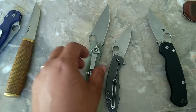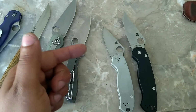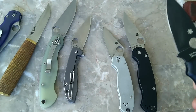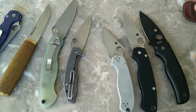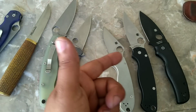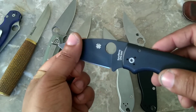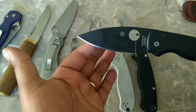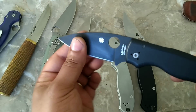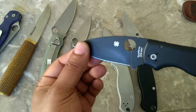Wear resistance compared to S30V. It gets bunched in. Some people look at the spec sheet, going off how much alloy is inside the steel, and you have more carbon and more alloy inside S30V. And so people will say, well, who cares about Cruwear because it doesn't have as much edge holding or carbide formation as S30V. The thing about S30V is S30V doesn't have an insanely high amount of edge stability. It really seems like it wants a more toothy edge.